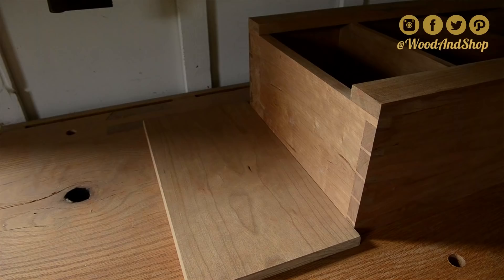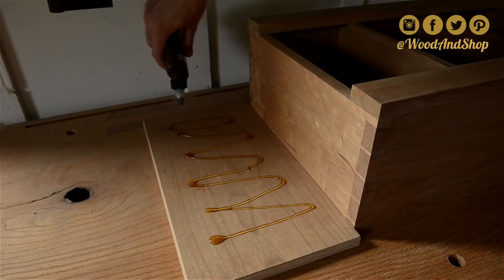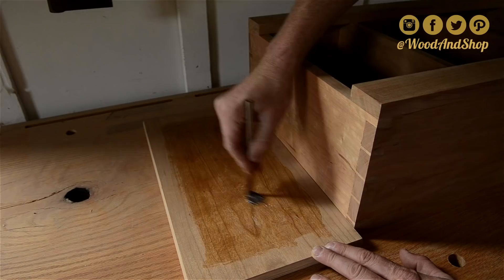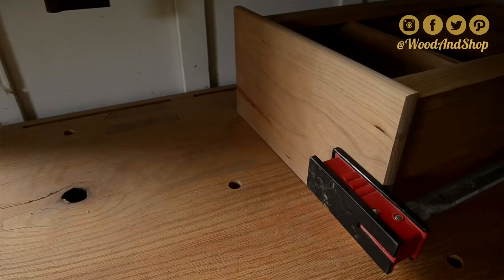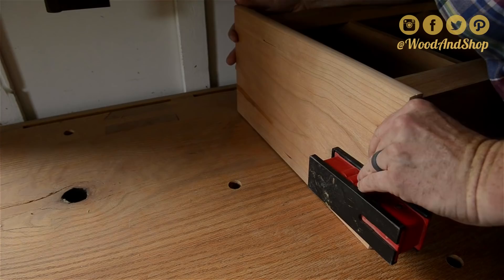Here's the bottom. I'm using a different type of glue here — liquid hide glue. Just make sure it's not too old because it does expire. This is the old-fashioned style glue now available in a handy liquid form so you don't have to melt down the crystals. I put it on and rub it to spread the glue, then add some clamps. I've found that putting nails in the bottom isn't really necessary — the glue seems to hold it just fine; it's not structural. Then I go ahead and sand down, scrape, plane, and put a finish on what I've put together so far.